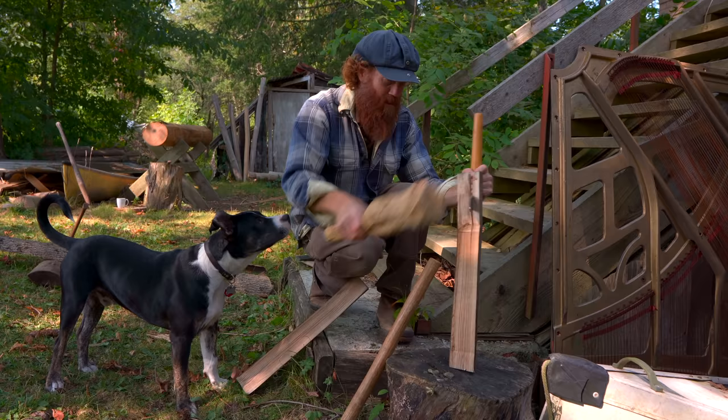That's about a block of it. So I think we have to mark the middle of that. Mm-hmm. At 4? With the pen, or do you want a pencil? See the side that has the rough? That's the side to mark. Okay. Mark the middle. And then I want to take out 1 3/4. You good at math, figuring that out? Yeah. So then from the 4, you want 1 3/4? I would do 2, and I'd take a 16th off of each end. That's how my mind works.